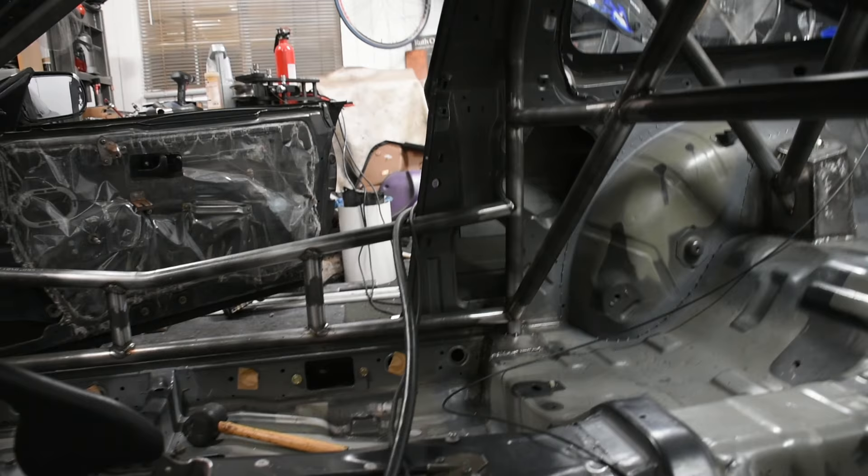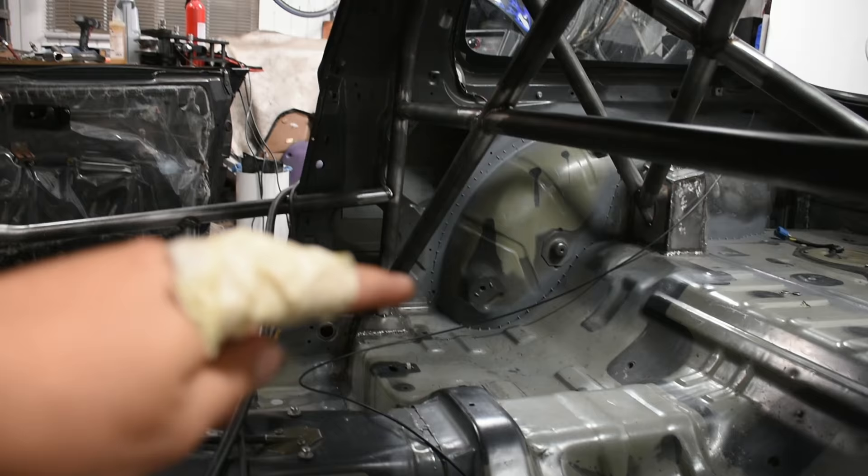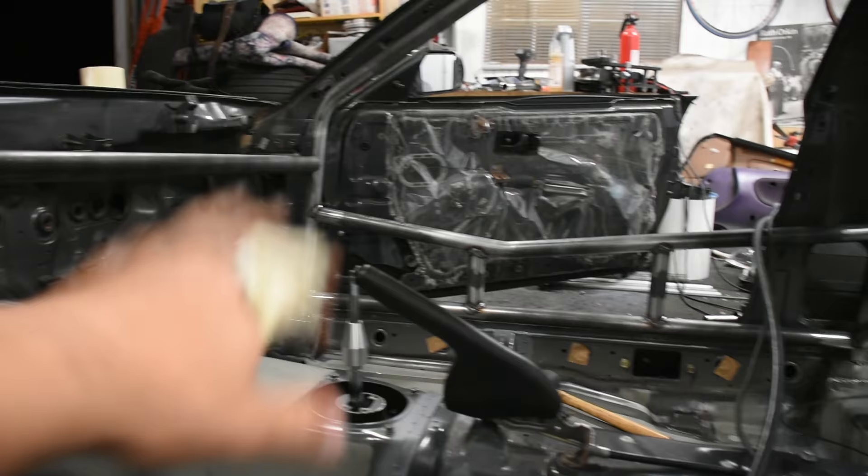More so, I need to move the cage forward so I can weld around the back over here, which I can't do by cutting roof holes — so it just needs to move forward. What some people also do is cut holes in their floor. But when you cut a hole in your floor you're going to have to patch it, which I think is a little bit weaker than just moving all of this forward. And if you actually have to have your cage slide forward you're going to end up with huge holes in your floor. So really the only way to do it is to make a box base plate, drop in, and pull it forward.